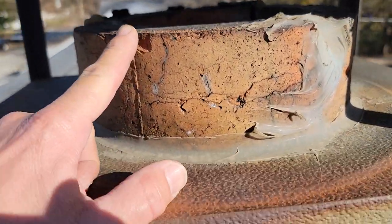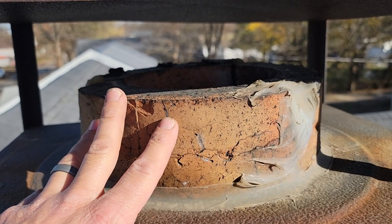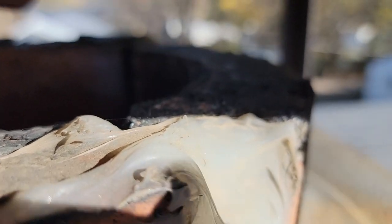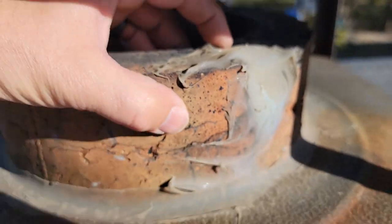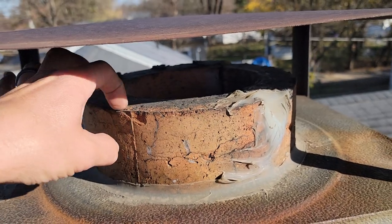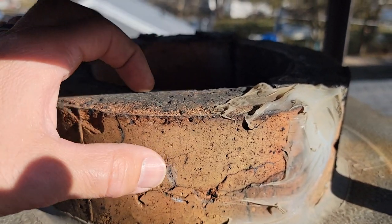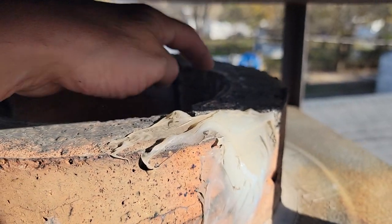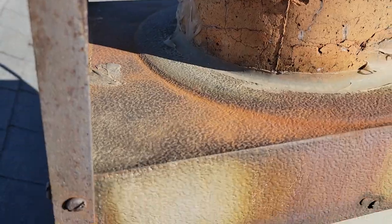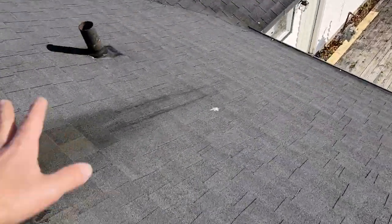Looking at this, I'm not a fan of doing anything with these chimneys because I'm not going to do stuff I'm not technically supposed to. Most of these style chimneys — if you look down inside — you typically find terracotta style chimneys. There's a thin layer near the inside or outside, filler in the middle that's got vermiculite in it, and I've also seen an asbestos round tile wrapped in terracotta. I don't want to mess with this. They didn't use me in the past — they used the cheaper guy to fix the mess on the garage and do something here.